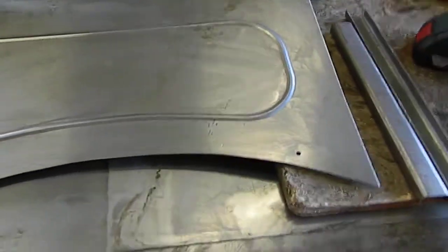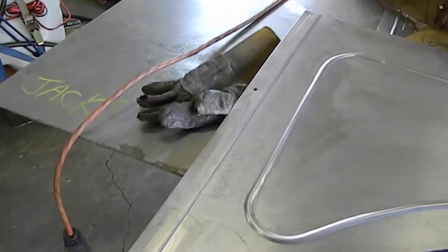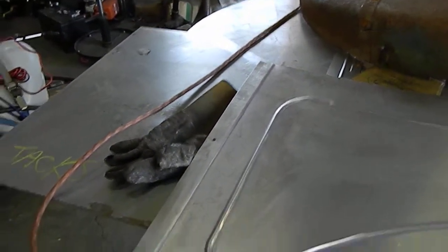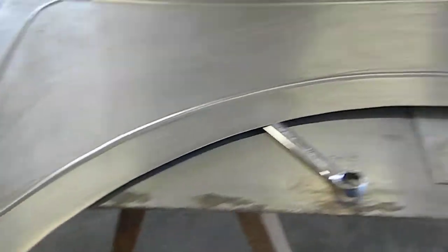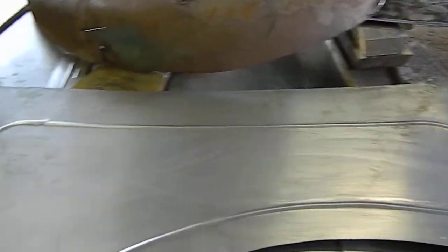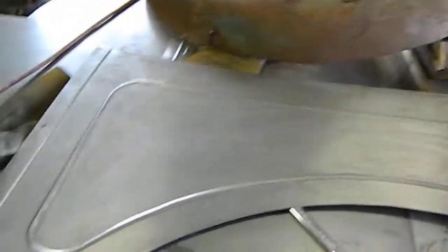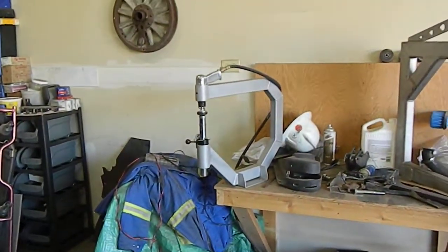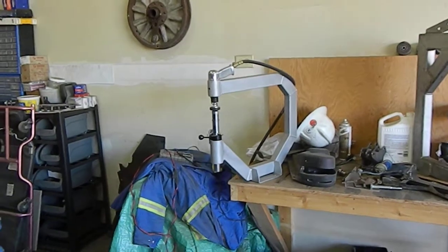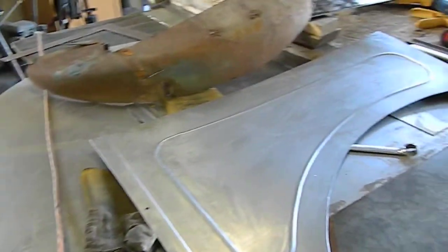This is the interior panel — it's made out of 20-gauge. I broke it on the edge on the Princess Auto bead roller and put the decorative bead in. Finally got that figured out. You cannot put those beads in unless you pre-stretch using the planishing hammer — it takes all the warp out of the steel. Works really well.